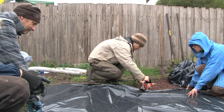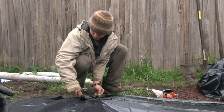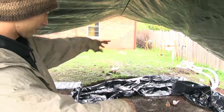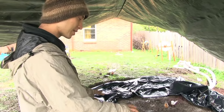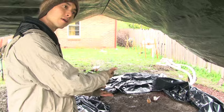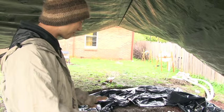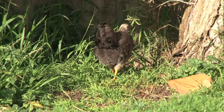As a second precaution over the scoria, we've added a waterproofing membrane. The principle is we're putting this whole layer around and laying our first layer of a packed earth bag, wrapping it around just for the first layer, so there's a separation between the moisture underneath and the actual building. This is the finicky bit of the building at the beginning because you want a strong foundation so your building doesn't sink. Once you've done this properly, the rest is really fun.